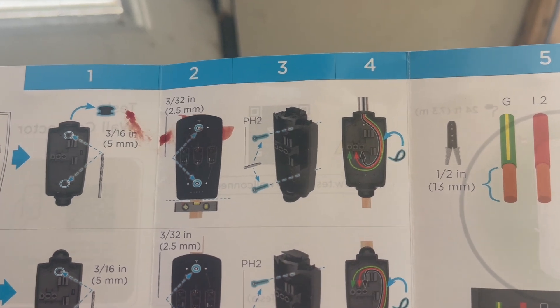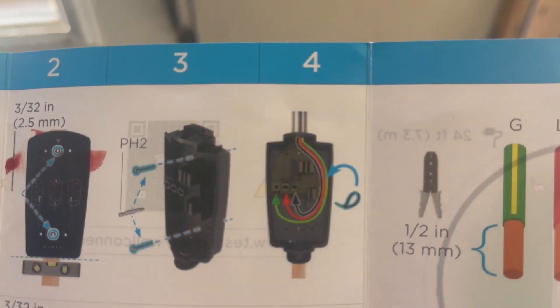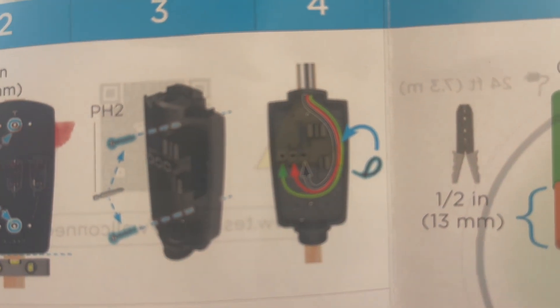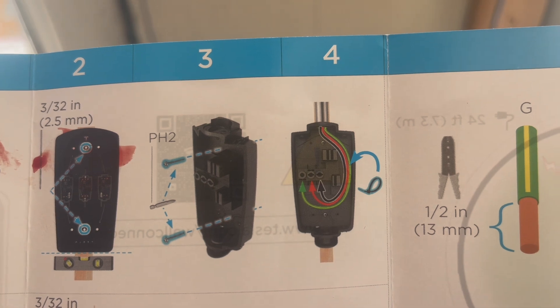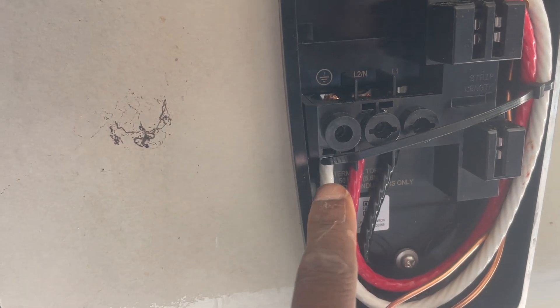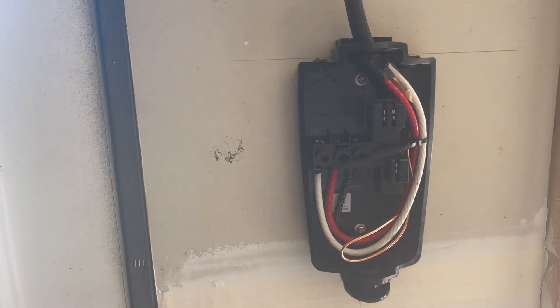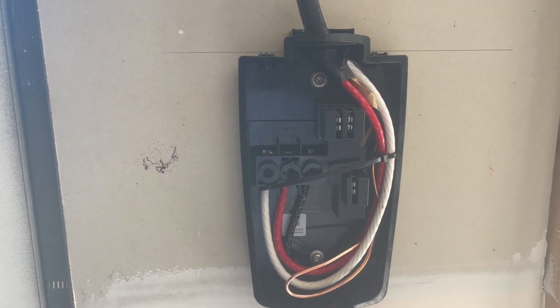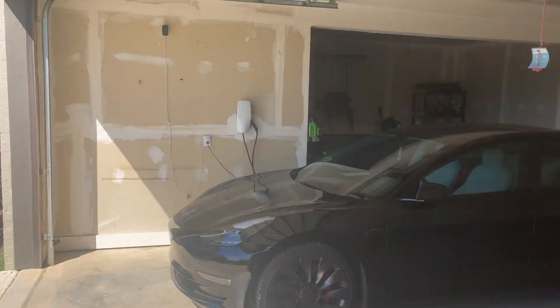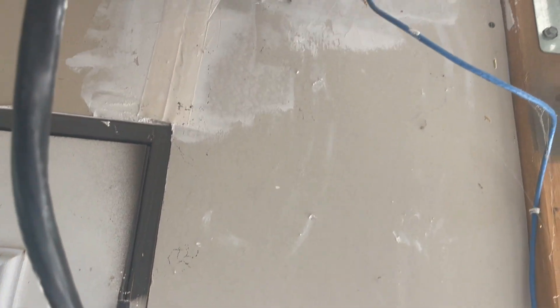Following the sheet here, I'm going to use number-four wire and drop it in. I've already run the lines — it's black, red, and green. Mine looks a little different: I have black, red, and I'm using the white wire as the green — that's my neutral/ground, since there are only three wires in my panel. I've already wired one of these up on the other side so they'll work the same way. I'm going to put a sleeve on this and take it up to make it look really good.